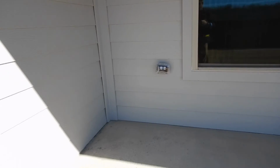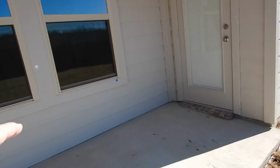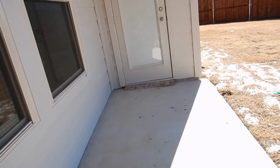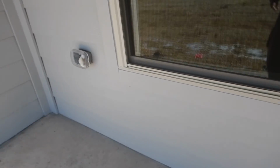Okay. So moving along. The siding is supposed to have a minimum of a 2-inch gap around it. A minimum of 2 inches. And we don't have that, and that's to keep water from wicking up into it. Oh, this is cement siding, but you don't have to worry about water wicking up into cement siding. Really? Is that true? How come the manufacturer doesn't say that? Why is that? Okay, so we're moving on along.